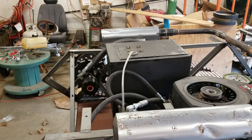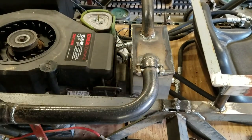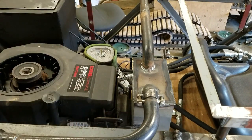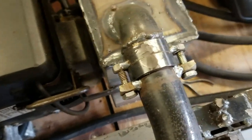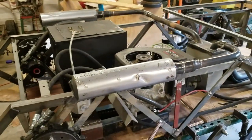Hopefully it'll be quiet enough that you don't need ear protection — that'd be the best case scenario. The exhaust is in three pieces: the two side pieces and then the muffler, so I don't have one big awkward piece when I need to paint it or take it apart. They're connected with flanges that were originally attached where the exhaust met the engine on the motorcycle — I just butted them together, welded a nut on, and they bolt together with a quarter-inch bolt. Works really well.